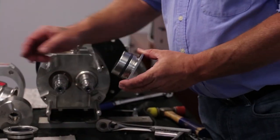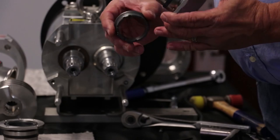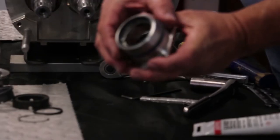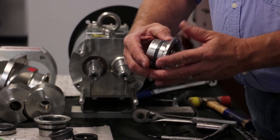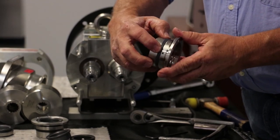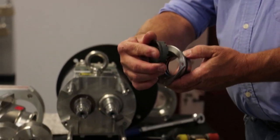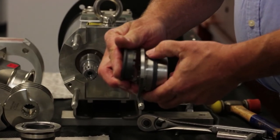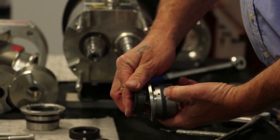When evaluating the mechanical seal housings, inspect elastomers and housing components. Note the notches on the back of the seal faces — these are to keep the faces from rotating inside the housing. Also for the double seals, it enables a pathway for the seal flush to fill and exit the seal flush chamber. If the notches are not in the proper location, this will cause damage to the stationary seal faces as well as insufficient flushing of the seal flush chamber.